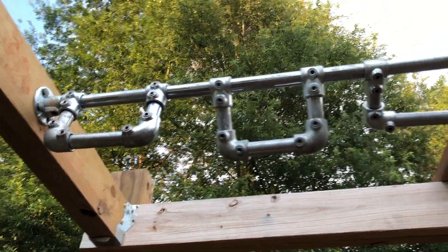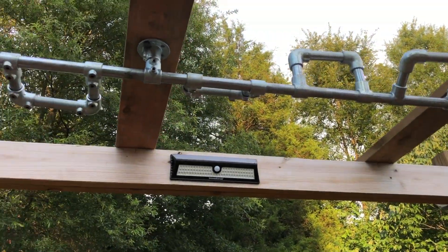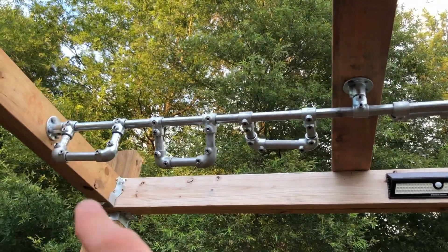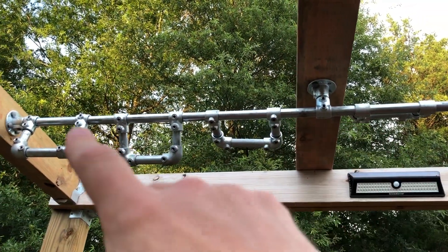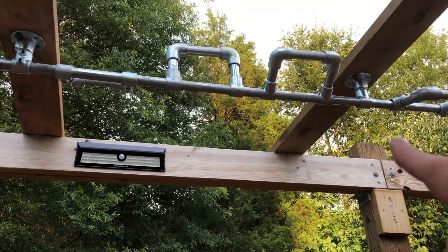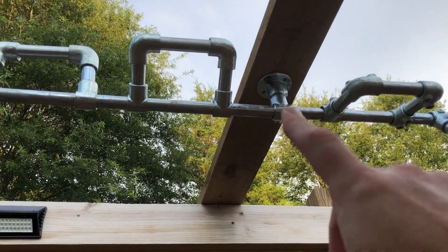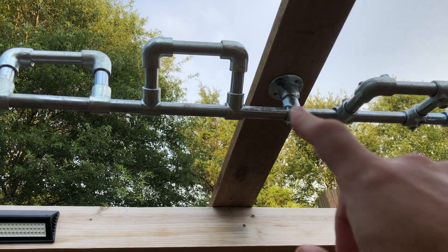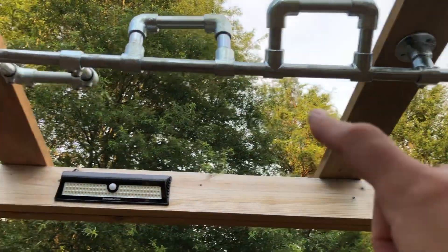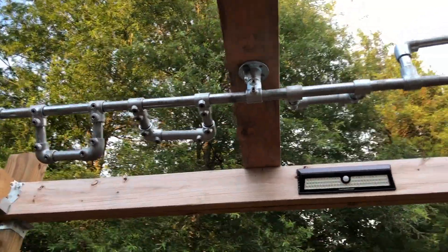Because it's quarter inch pipe, you'll need to brace it at least twice. What I did is divide it into thirds — it was 115 inches divided into three sections, evenly placed. I've got three handles per section, and then I just bought another T joint, another wall mount, and a very short piece of pipe in between that I locked down — but I didn't lock that one so the pipe could still slide through the T.